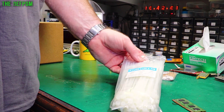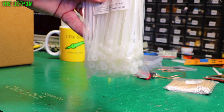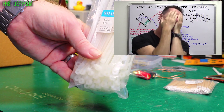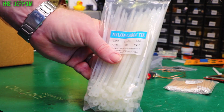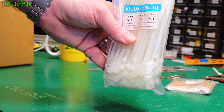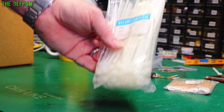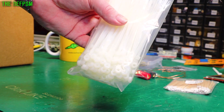These are cable ties with little loops on the end so you can attach them to a surface and then cable tie cables up - good for cable management. I've actually got some black ones somewhere but I bought more black ones, only these turned out to be white. The black ones have carbon black in the material, which is a UV stabilizer - it helps absorb UV light and makes them more weatherproof. These white ones will go brittle and break pretty quickly, probably within a year or two, because nylon does not like UV. The black ones are far more weather resistant.